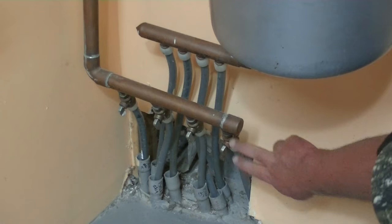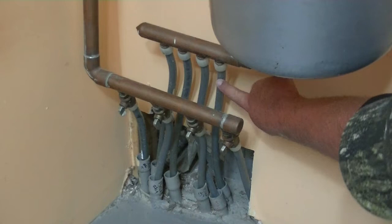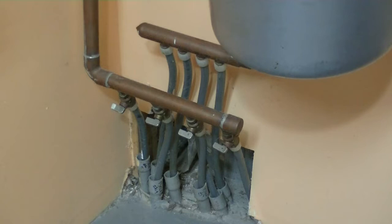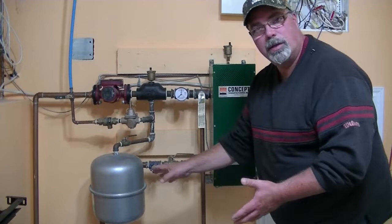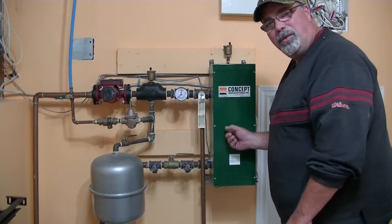The hot water comes down to this set of valves, and each one of these would be called a zone — basically, your room. Then it goes down into the ground to the room, and then it comes back out here to this manifold, and then goes back up to be heated. What we're going to do is turn off all of these valves, and then once we hook up our water we're going to open one valve at a time and flush that zone out until it runs clear out at the street. We have the gist of how the water cycles — it actually cycles this way. So we don't want the sludge going through the boiler.